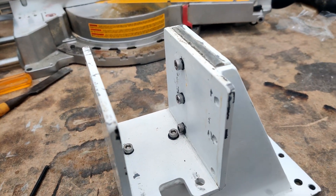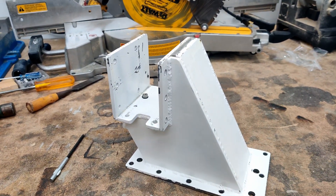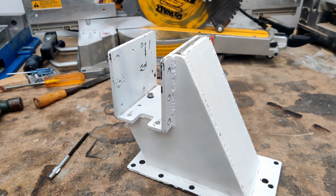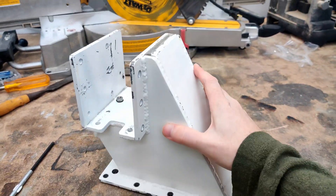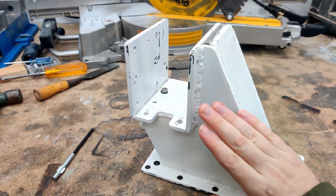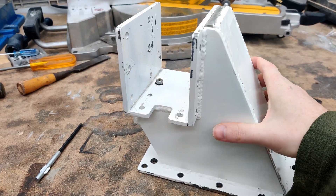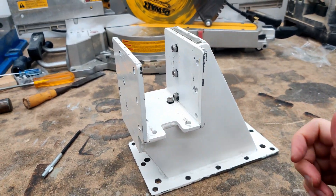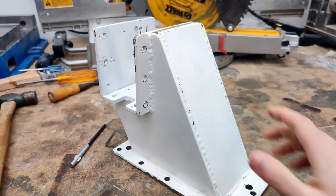I'm not sure about curing time — how long it's going to take. If you look online, a lot of grout information will say like 24 hours, 48 hours, 72 hours. Generally what they're going to be talking about is grouting tile. If you're filling in a confined space like this, it's going to take much longer because the water, as this thing flows to the bottom, just has nowhere to go, keeping everything a lot more hydrated and increasing the curing time. From what I can tell researching this, the whole piece will continue to increase in strength — probably taking about a month.